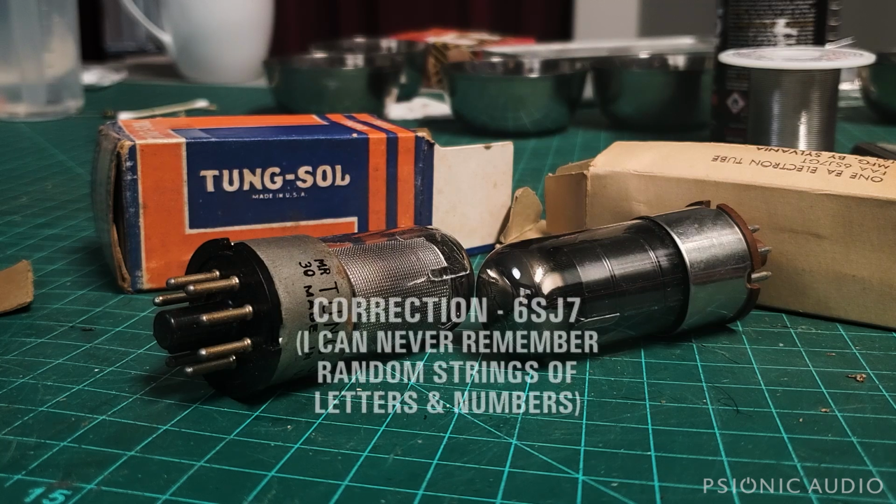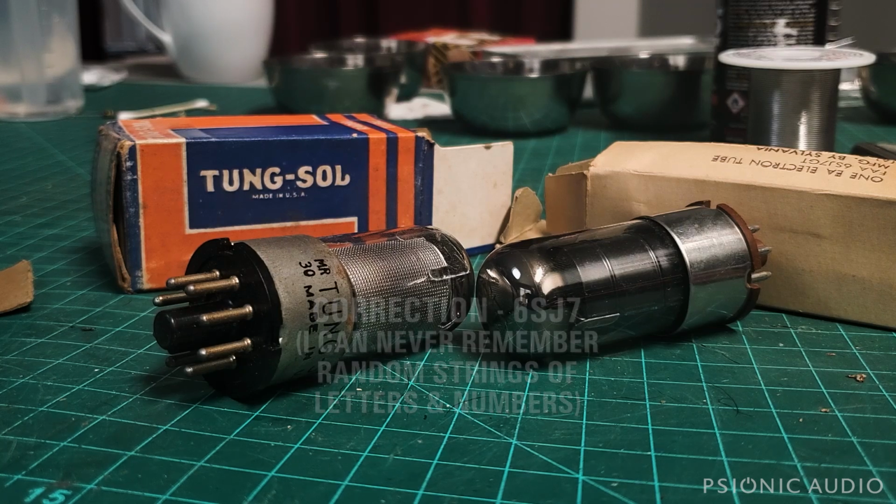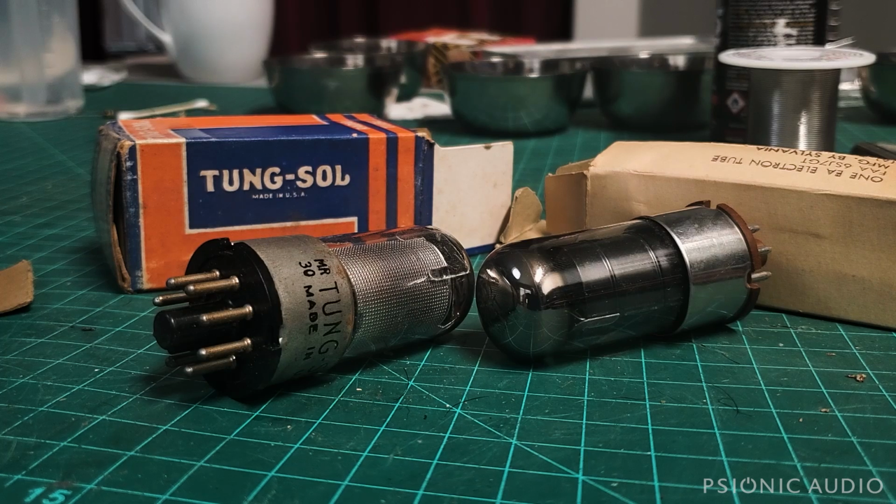The other thing I discovered is that the wood where the two screws that hold the chassis to the cab go is just crumbly and not reliable. So I'm going to see if I can use a longer screw or the next size up, or whether I need to get in there with some epoxy or whatever and make that cab accept a screw. So I'm going to put these tubes in, but the chassis itself will have a little bit of vibration because those screws are still not secured. So it may have a little bit of a ring.